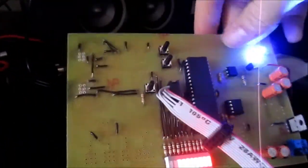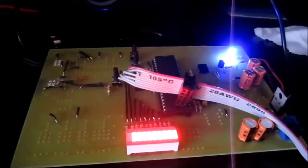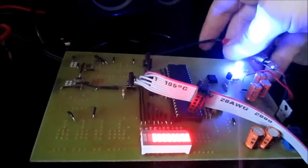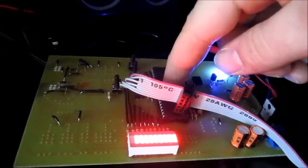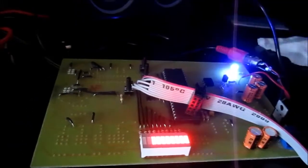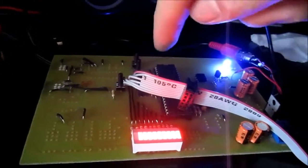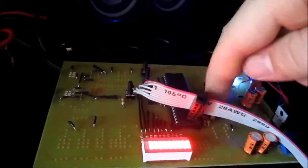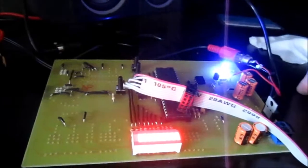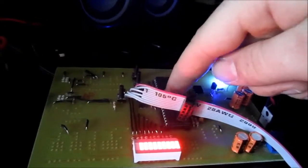And then finally, the biggest problem was in the test program of the software. During the interrupt, I was outputting to the LCD screen, which means it was having a delay of around 10 milliseconds. When I took out the LCD software, that 10 millisecond delay was taken out of the interrupt sequence. And that makes a big difference. That 10 millisecond delay, I guess, acts as the debounce for the trigger circuit so it doesn't go crazy. So I put in a 10 millisecond delay in place of the LCD code, and now it works fine.